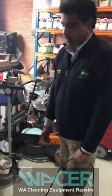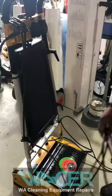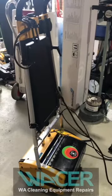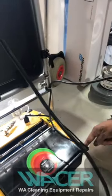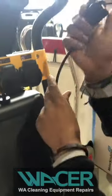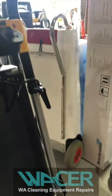Now we need to connect the electrical side of the motor. Turn the levers down and remove the electrical cable. You've got the base cord of your Rotowash that plugs onto your motor — it says 'motor' and can only go one way. Plug it into the motor and it's nice and neat.